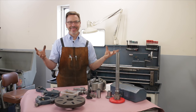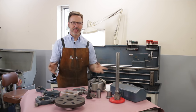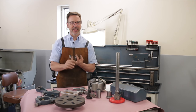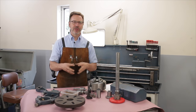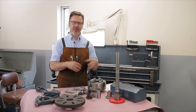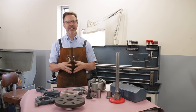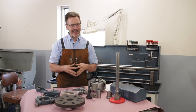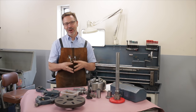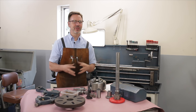That's a great background on how to buy a metal lathe. You want to make sure it has some tooling with it. Bring tools and cleaning supplies so you can inspect the machine thoroughly — go through the entire machine, operate every lever, check every gear. A good inspection for me takes about an hour if there's easy access. Sometimes they're in a dark back corner, so bring an extra flashlight or two. Don't forget to bring your phone — you can take pictures of it.